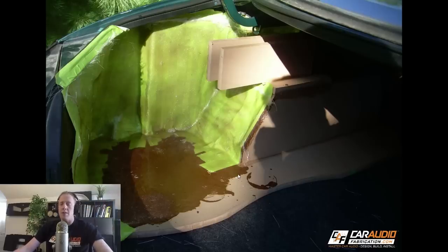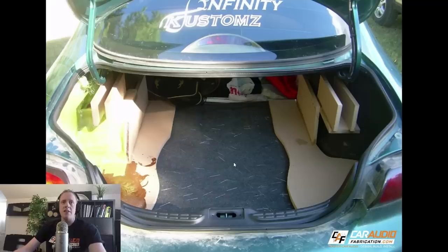I cut the two different sides with a jigsaw and tried to make them as consistent as possible. But ideally, this is why having a router is nice. I could have started with one side, sanded it down nice and smooth so you couldn't see those jigsaw marks, and then copied that profile using a router with a flush trim bit to the other side.